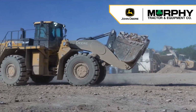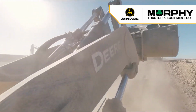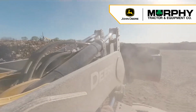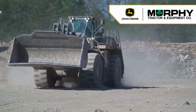When they're driving through a dusty quarry, it's pretty important to have high visibility, and we're able to maximize that as well with our integrated spill guard, where they can still see the corners of that bucket when it's rolled back and in that tracking position. We made sure we used the John Deere specific bolt-on cutting edge. Murphy Tractor, as the John Deere dealer, is able to support them with that specific part.